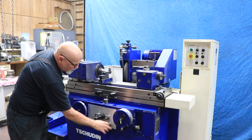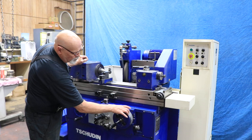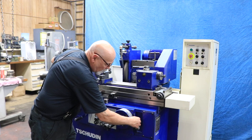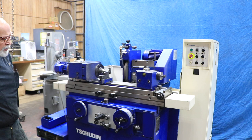This also has a coarse feed and a fine feed. There's a dial here — you loosen the set screw and move the little mark closer to or away from zero to open up your fine feed, so you can come down to zero nice and slow. There's a dead pin — you want that to be in. After a certain amount of time it goes back all by itself: the wheel goes back, everything shuts off, and the hand wheel retracts by the amount you just ground off, plus a safety margin.